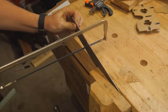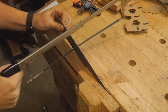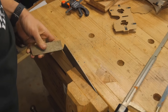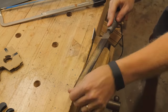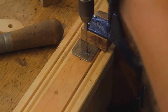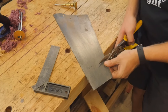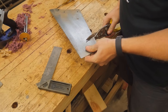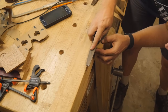While that's drying, I can start working on the metal parts. There's a piece of metal that has to hold the blade against the handle. I had a square that was not square and figured that would make a good piece — I was able to cut off a chunk of that. Once cutting it, I could go through with a file and clean up the corners and make it smooth to the touch. Then with the drill that I recently restored, I drilled out an eighth-inch hole and then a quarter-inch hole to allow the bolt to slide through. The cutter was made of an old saw plate — I recently did a video on making scrapers out of an old saw plate, and this is basically the exact same thing because it's just a scraper that goes inside.